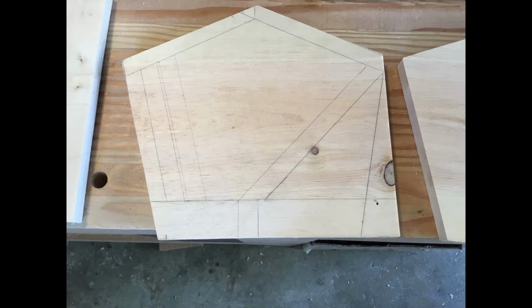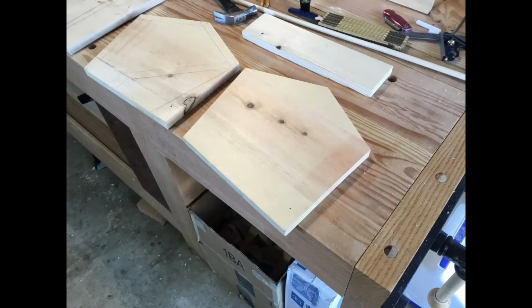By keeping it on an angle like that, it'll feed by itself. The 2 3/4 pieces house an 1/8-inch piece of plexiglass that will end at that height. The 2 3/4 members, again, go all the way down to the bottom of that panel, but the plexiglass ends at that height, and that will show me how much feed is left in the bird feeder. Here are the 2 panels, and it shows that one end is square and the front end leans forward at a 15-degree angle. And that'll be more clear as the build goes. You'll see better why I designed it that way.